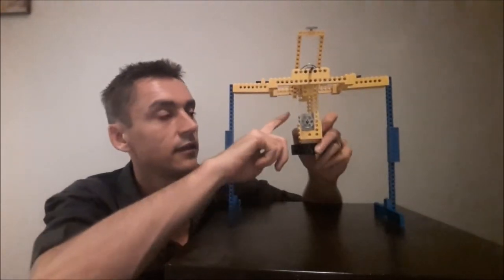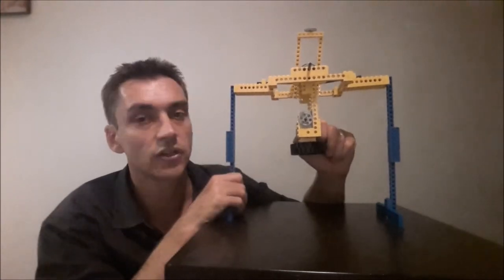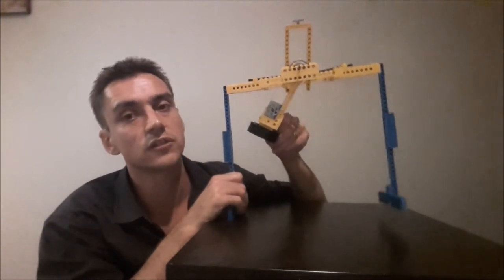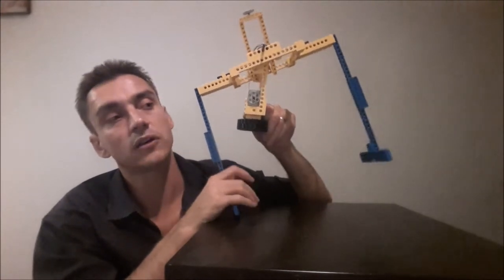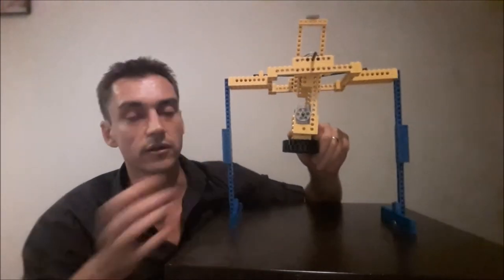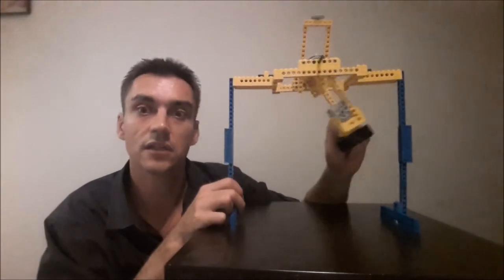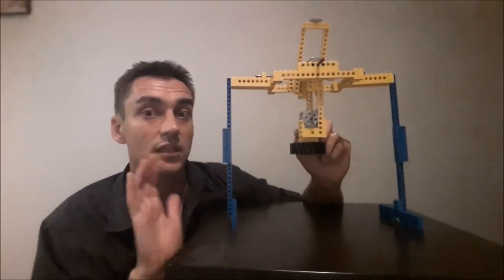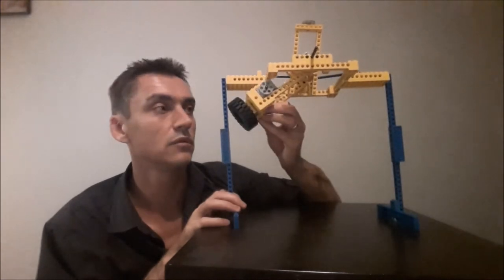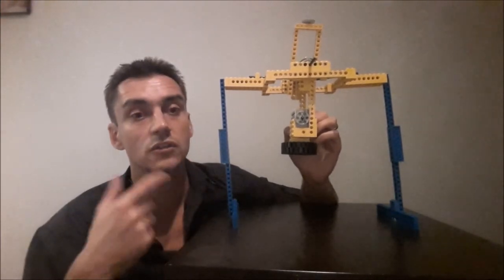Steering is slightly different. There's one motor for steering whose output is attached by steel cables to the main frame, and turning that motor moves the heavy mass from side to side. When the mass is over on one side, it causes the sphere to tilt over, and because that mass is now on one side the sphere will tend to roll in an arc — just like crown green bowls, where the weight on one side of the ball makes it curve. To steer the other direction you just swing it the other way. To adjust the tightness of the curve, you can either adjust the amount the mass is leaning — the more you move it the tighter the turn — or you can adjust the speed BB-8 is rolling at.